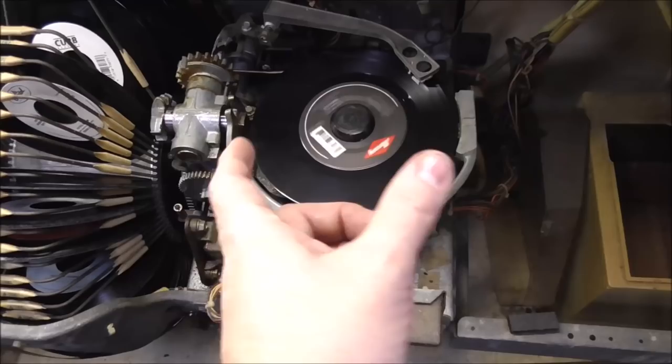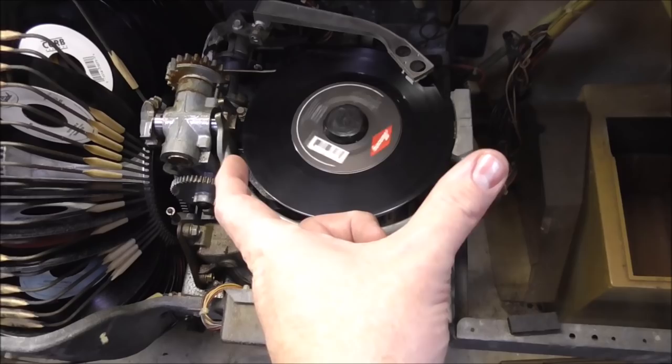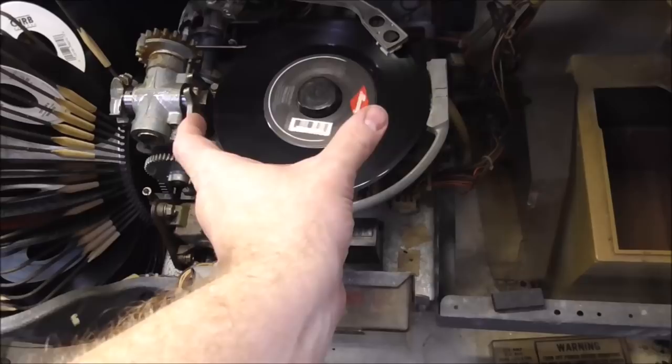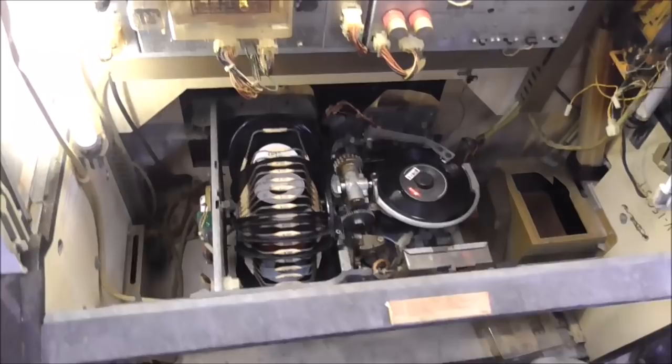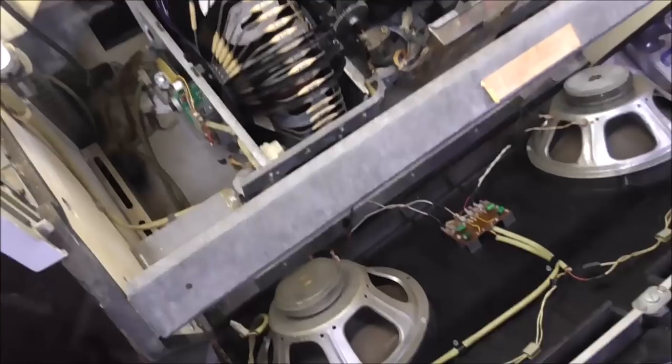So you'll see, right when it starts, this arm is going to lift up a little bit, and then the piston's going to come out and grab a record in air about an inch above the record that's on the turntable. Then it'll hang that up, and the record will still be on the turntable. If it's doing that, it's because you need to take the whole thing apart and clean it. So let me get here where I can hit the cancel switch. Now watch, you'll see it do exactly what I'm talking about.